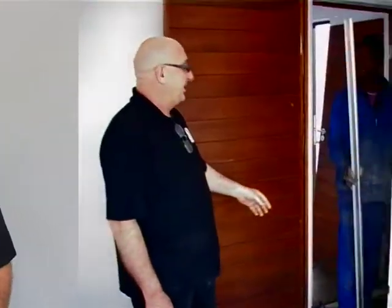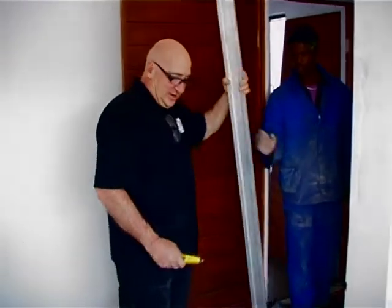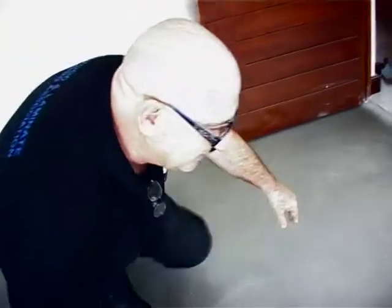But you can just see the quality of this type of self-leveling screed, how beautiful it comes out, and level. So in a minute I'm going to get a straight edge and show you how flat it is compared to what it was originally. So let me just get that straight edge quickly. Gift, thanks. I've got the straight edge. Let's have a look how we're looking here. So we'll put the straight edge down here.